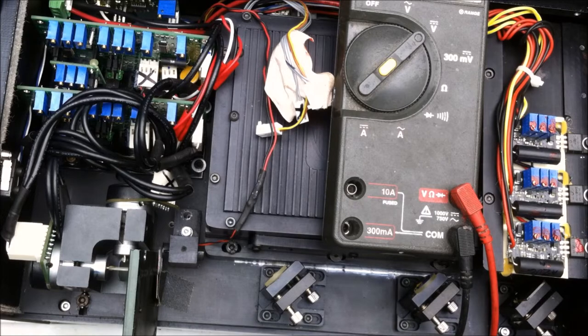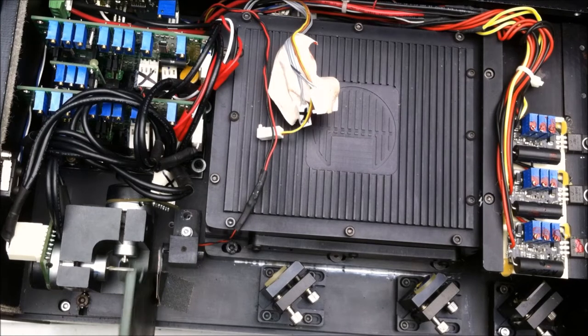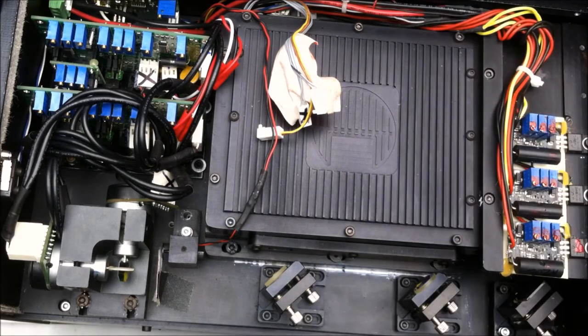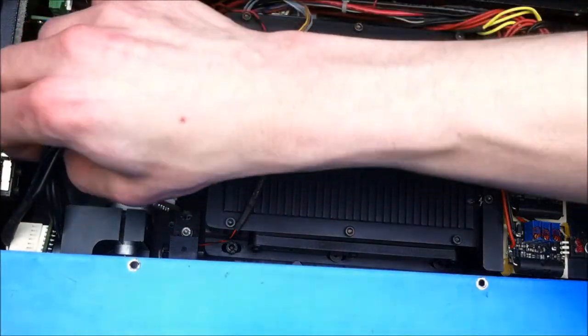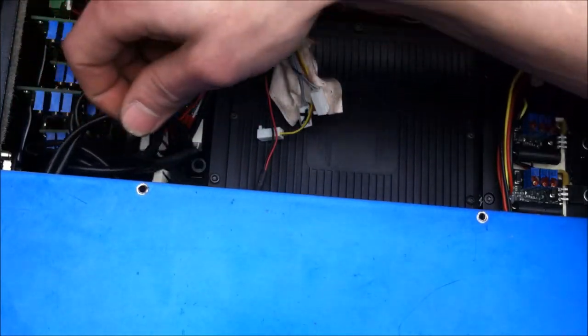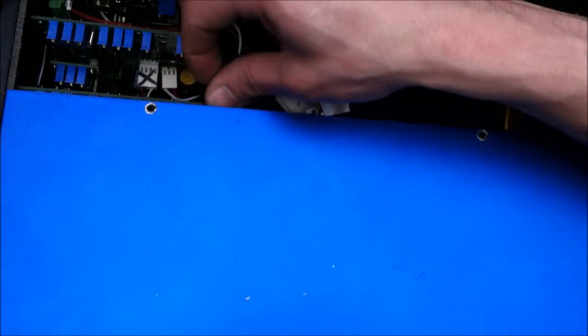I think I'm going to turn it off for the time being, and see what's wrong with the other one. Get this laser put back together, and go from there. Check out that power supply. I'm betting that the power supply got damaged and then took out something. It does look like the galvo amps are good. I don't know if the galvos are good though. I'm very suspicious of that power supply though. Get in there. Make sure that cable's good.